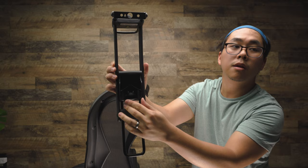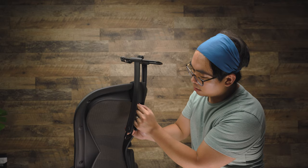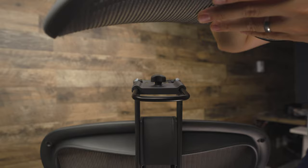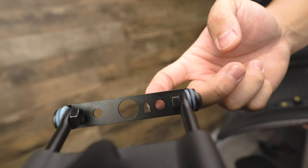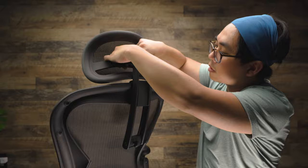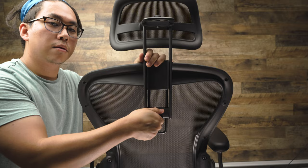For the suspension headrest it comes in two pieces: the headrest itself and the metal contraption. Install the metal contraption the same way — take the top claws, find the divot of the chair, lower it down, hook the bottom hooks into the underhang, find center, and tighten that screw. Then take the headrest, find the holes on the metal contraption, and insert it in. There's a raised arrow on the headrest and a corresponding hole on the receiving end so you can't get it wrong — make sure the arrow faces up, pull it in, tighten the two screws on the left and right side, place the plastic cover over the metal, screw it in, and you're good to go.